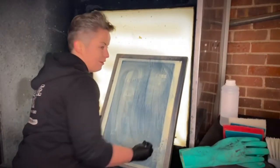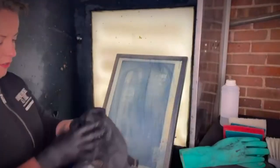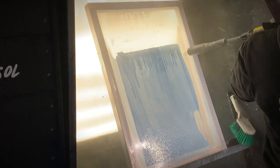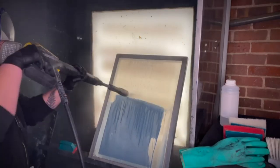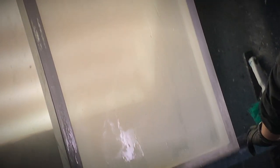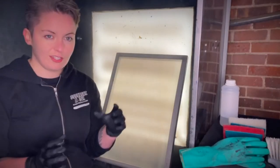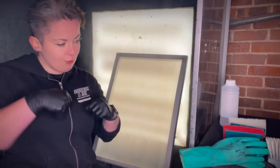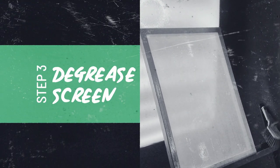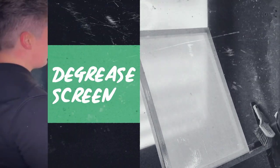I'm pretty sure that's going to come up nice now, so I'm going to put my mask back on. That came off very nicely, and what you're going to find is that these edges — sometimes if you've got a little bit of thicker emulsion on those sides — you just need to go a little bit closer and that pressure from the power washer will just lift those off. We're ready to do our degreasing now, so I've given it a bit of a rinse.